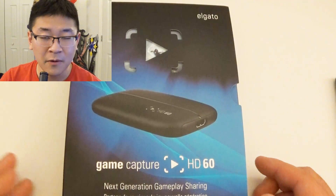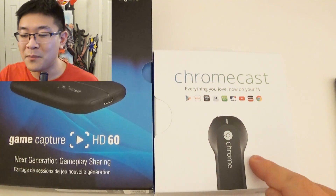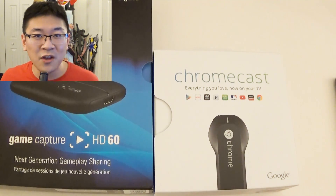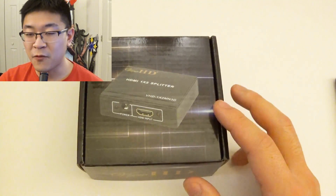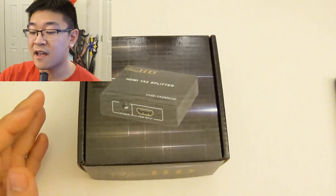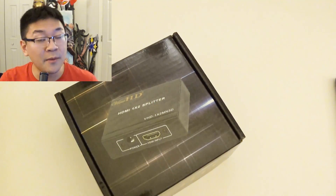Now, I'm going to go over how you set it up later in this video, but that's the second piece you need. You would think you'd only need those two devices, but you actually need one more thing. If you haven't seen my previous videos, Chromecast has a built-in security feature called HDCP, which prevents anything from recording the video images emitted from the Chromecast. The solution is this little guy — an HDMI splitter. Not all HDMI splitters will strip the HDCP signal, but this one was proven, and I've tested it, and it works. It splits the HDMI signal and in that process strips the HDCP, allowing the Game Capture device to actually record the video.